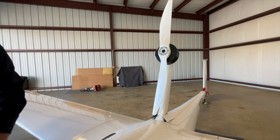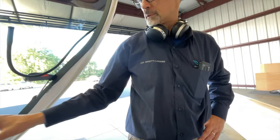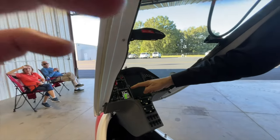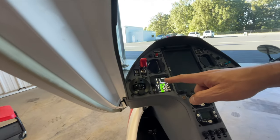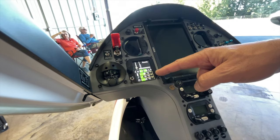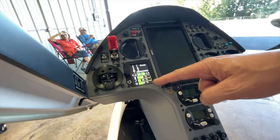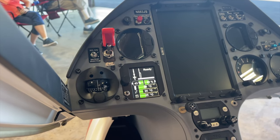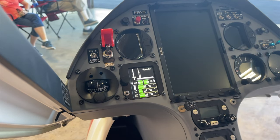Right now I'm not going to turn the throttle knob — it's armed and it'll spin. You can see it's showing it's ready, it's centered. You've got the two battery voltages, battery temperature, motor temperature — that icon is the propeller — and it's showing the controller temperature. Cooling fans are not running. The cooling fans kick in at 40 degrees Celsius.